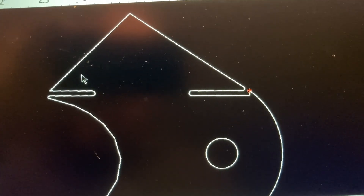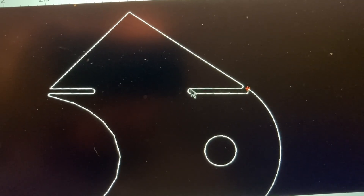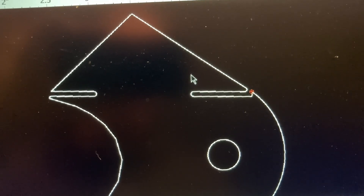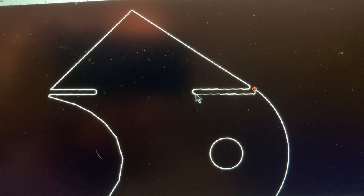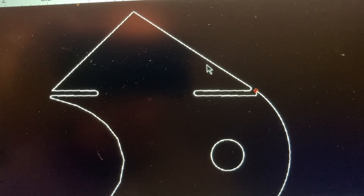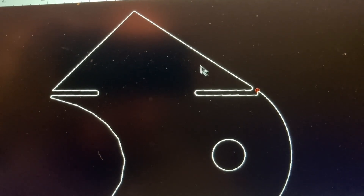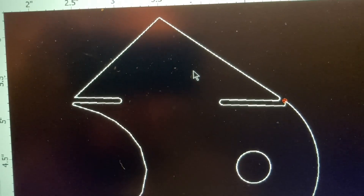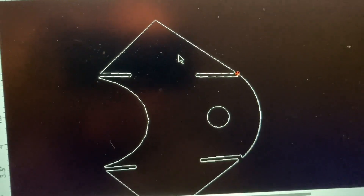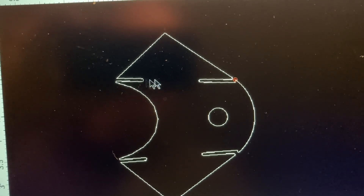I line these so the length of this slit corresponds with the width of my bottom die. Basically, perpendicular from here up, this is where the die lines up. That way you have support 90 degrees up from the bend line to where the material is. As you can see over here, it wouldn't be 90 degrees up — it's coming out like this. This is kind of hard to explain, but once the part's bent, these slits just get welded up and ground smooth.